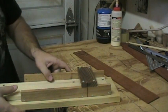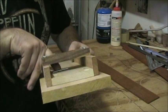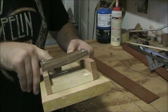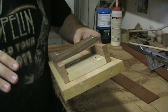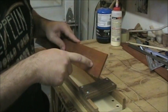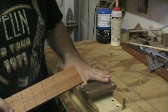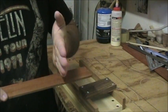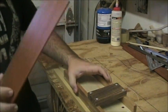Being square is really important to make the slot straight. Before you glue everything together and screw it down, you have to insert a little metal spacer. I used a razor blade with the sharp portion shaved off - it happened to be a slightly thicker blade that fit perfectly inside the slot. This is how we index it: every time you slide the board through here, it locates on one of these slots, so a board taped to the side will get slots cut in the exact same locations - essentially a machine that duplicates whatever you give it.